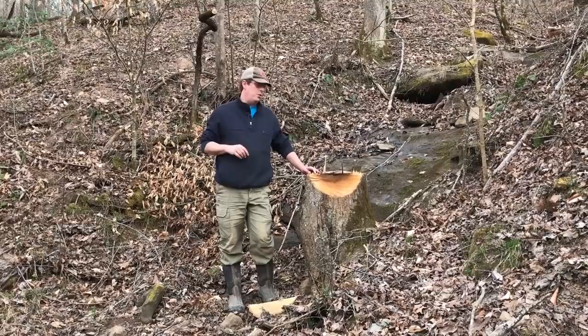It's where the tree obviously had a little bit of a curl to it, but this big dark gash right here actually has a little bit of purple in it, which is indicative of some issue here, some scarring, some dying of the sapwood as it was growing out. So this is just a turn. This is where the tree actually had a little bit of a bow in it, so that's why we see this green here. So probably not any metal or issues here, but definitely this spot right here, that really dark brown purplish color, could be an issue, but we'll see.